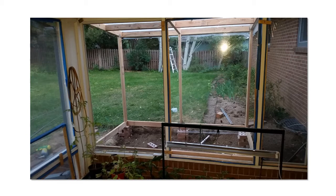Here's a view from inside the patio looking out. As you can see, it's not terribly unsightly for somebody sitting on the patio entertaining guests. Notice the windows from the patio to the greenhouse — I took the screens out and basically have thermal window film on them. Very clear. It's typically used for indoor purposes, and I've used it very nicely to keep this patio warm during the wintertime, and I'm going to use this for my greenhouse. You need a double-layer plastic film to get heat insulation during the wintertime. With twin layers of polyethylene translucent sheeting, you'd only be getting about 60 to 70% light transmission, and light is at a premium here, so I think this is a very good solution.